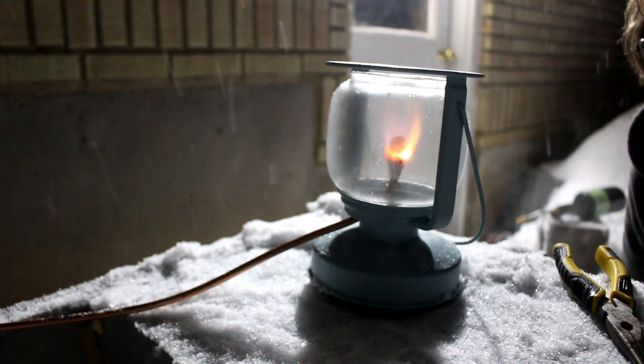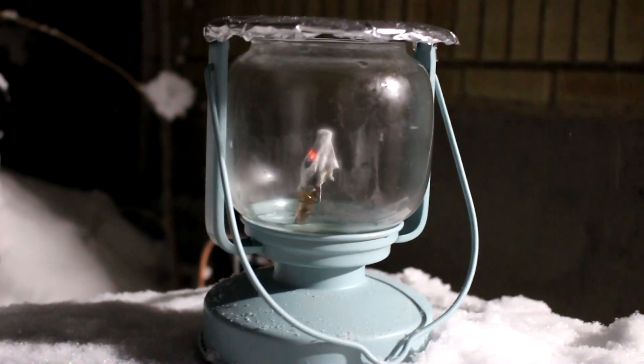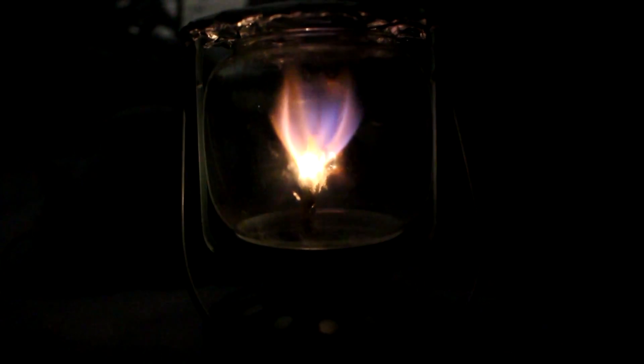Let's push on the gas and see. Oh yeah! Let's go find a cover for it. So there is the completed lantern — a little gas mantle in there is burning. It's a tiny light, probably dimmer than a candle, but it is working. And that's just the amount of gas that this generator is producing constantly. Theoretically it could stay on like this for as long as the methane generator is producing methane, which could be months. Of course, if I wanted to get brighter, I could put a weight on this gas bladder — you can see it'll brighten right up. That's probably about the maximum. And if I release, it goes back down to the standard level.